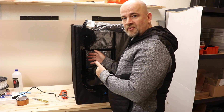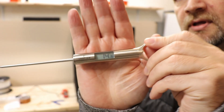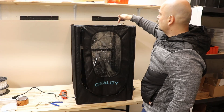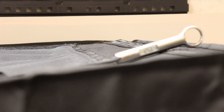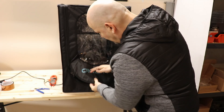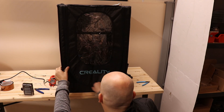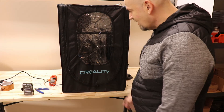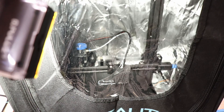One of the disadvantages of this setup is that it is less comfortable to work with — it's a little bit harder to replace the filament, for example. The room temperature is approximately 15 degrees Celsius. With this sensor I can follow the temperature inside. You can see it going up. It's a little bit different than yesterday because it's now measuring at the top of the enclosure, but it will give us some basic information. I will try to watch the first layer and then I will close the enclosure — no opening until it finishes the print or it fails.